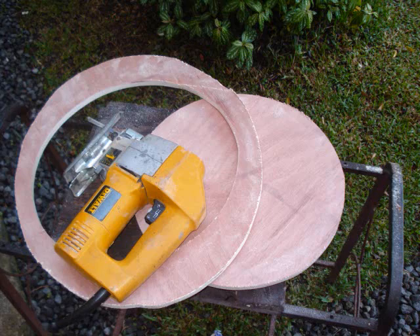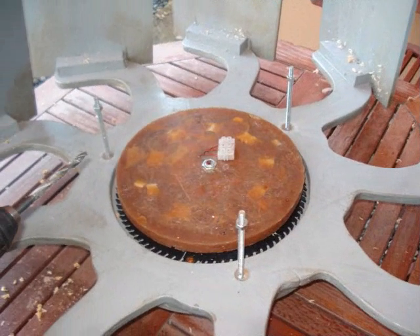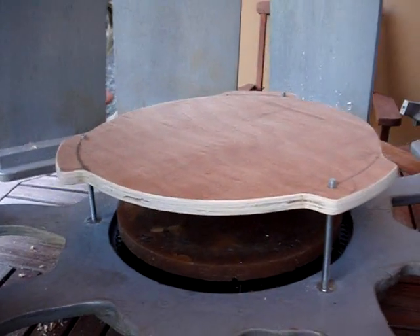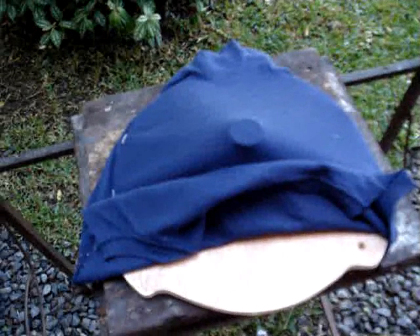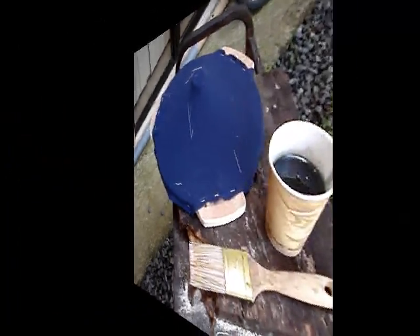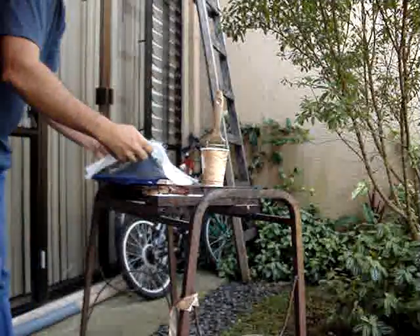In this video I'm going to show you how I finished off my PMA for this wind turbine. I used a piece of plywood for the top piece and three pieces of all thread to allow adjustment of the magnets on top of the stator. To cover the top of wood I used basically a t-shirt, stretched it over, stapled it in place, and then fiberglassed it to make a top for it to keep the rain from puddling up on top.